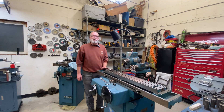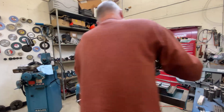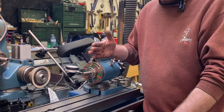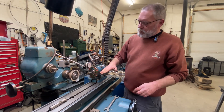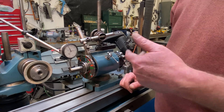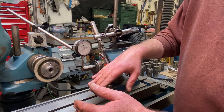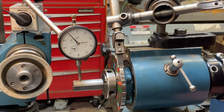My two remaining setups are going to be done with my sensitive work head, so I'm going to get that up there now. In order for this next bit to work out I need this fixture running true to the centerline of the table — I'm dialing that in now. I also need this fixture running zero this way, because some of the setup relies on us knowing reliably where center height is. If this is off zero then as you travel back and forth, center isn't consistent. So we need this running zero.